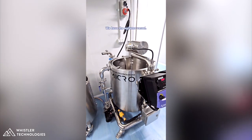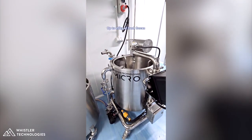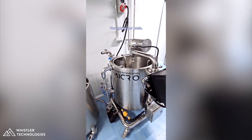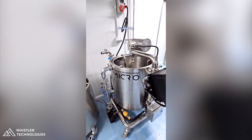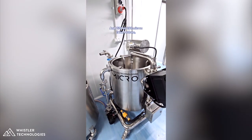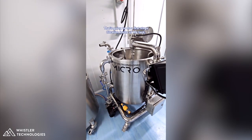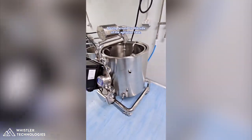With all of our systems we provide 100% drainability following biopharma standards. On the right hand side we've got the agitator vessel at 250 liter capacity, which gets you up to 20 kilograms of fresh frozen throughput per batch or 6 kilograms dry. It comes with our proprietary double torus mixing pattern and a 220 or 260 micron false bottom for first stage filtration inside the tank.